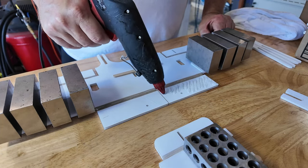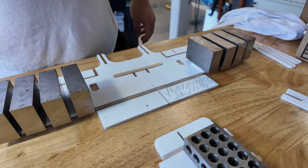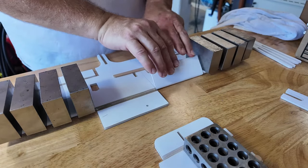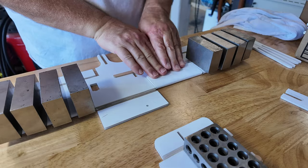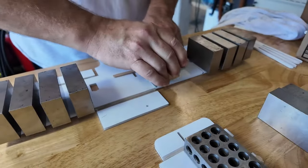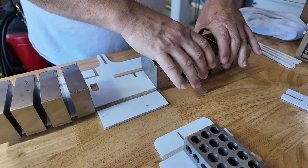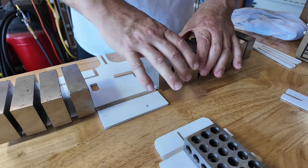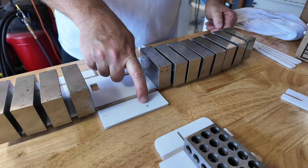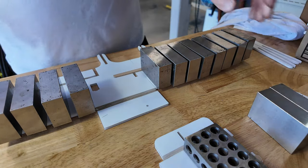You know, I'll say this thing's been remarkably durable. I've had it for, I don't even know, close to 10 years, maybe more. I've gone through one power supply, that's it. I'm still on the original tube. I don't run my laser more than, you know, maybe 70% at max duty cycle in terms of power I'm extracting from the tube, and it works well. Lasts a long time.